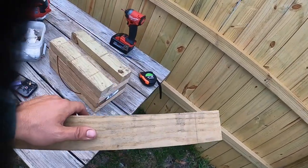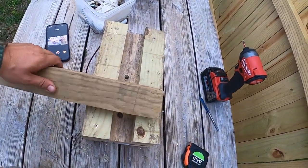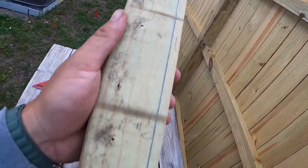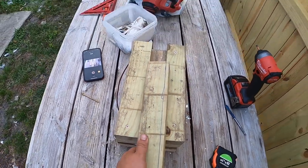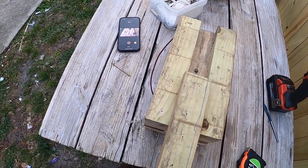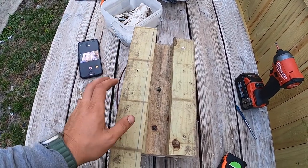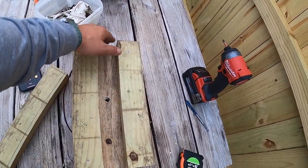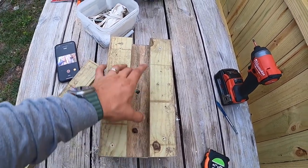Alright, so your one by twos are going to be a little wide. What I did is I just edged out what it will be to fit in here. It may be a little wide so it'll be tight — I'm gonna have to hammer it in, but I want that on purpose. Make this so it can fit in that hole snugly. I'm just going to cut this down and put it in two pieces — both are going to be about three inches long a piece, and then we'll be done.